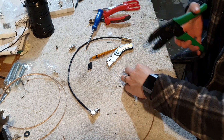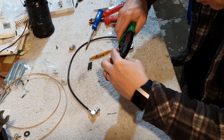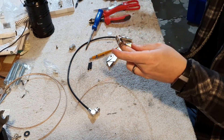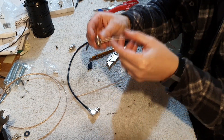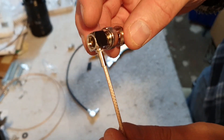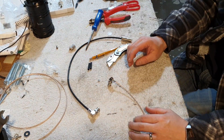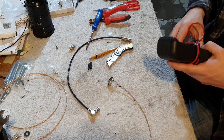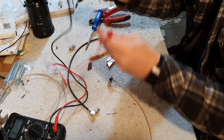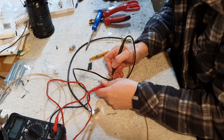Okay, this is a new one for me. I'll get the tool. Which one is it? Obviously the smaller one. Crush it — there we go, all the way. Okay, so that's actually made it into a nice little hexagon shape. See that. So now I need to solder our middle conductor. While I'm here I'll just check with the multimeter — handy to check there's no shorting. Okay, that's alright so far.